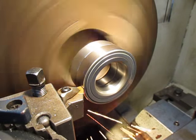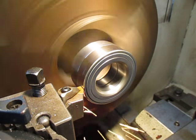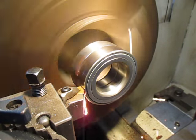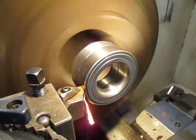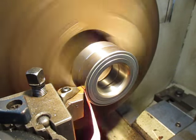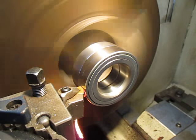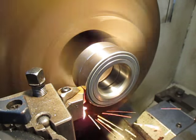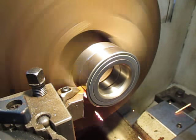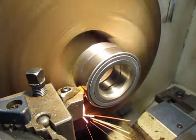You can work with hardened steel with the ceramic, but you'll be extremely careful because it's very brittle. I'm feeling my way through using the compound in this case, and I'm heading towards the chuck. I'll also cut back a little bit as well because there will be a little bit of load on this.